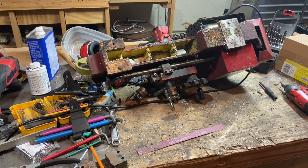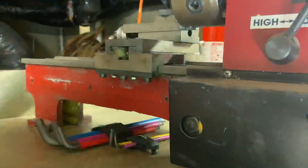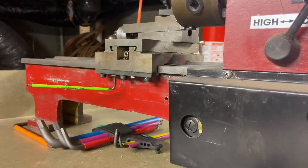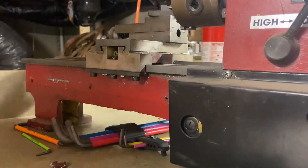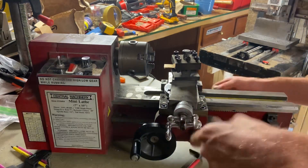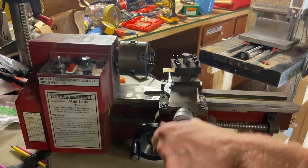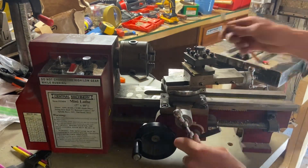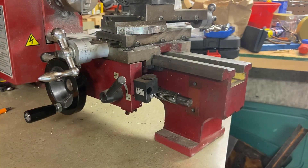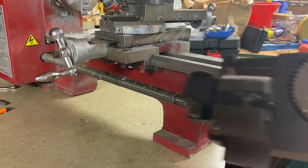Not the most well calibrated, but I'm taking everything off and going to re-tighten all the gibs and at least vaguely calibrate. I know a lot of people go and tune these up and spend a ton of time making them beautiful, but I just kind of need this to at least work while I'm making a better lathe in the meantime. I was kind of amazed how in so many places — if you want to change the compound angle — you need to screw the compound all the way out by hand, change it, and then screw it all the way back in again. It's surprising how time consuming it actually is even just doing it one or two times.